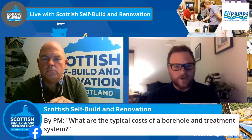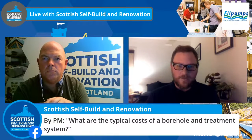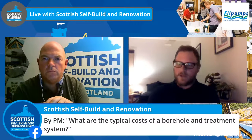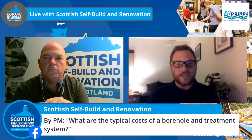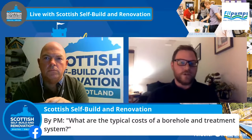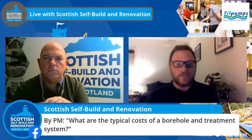Obviously a little 2-bedroom cottage, even if it needs the same things treated in the water as a large property, is going to have much smaller equipment and therefore lower cost. Case in point, we had an email from a building company who's building an 8-bedroom property with everything en suite and an extra facility. A property like that, even if the water quality is the same, is going to be more expensive because water is going to get drawn through the system much quicker. So you need bigger vessels so the water has enough contact time with the filters and treatment media.